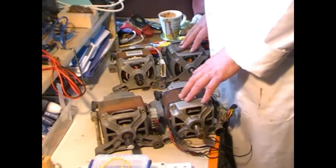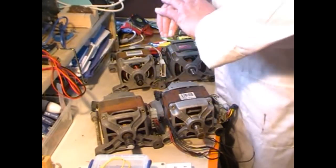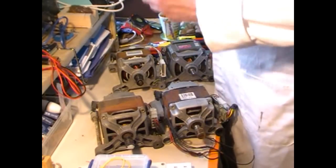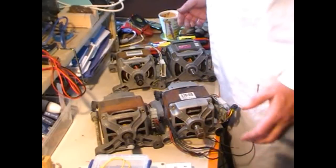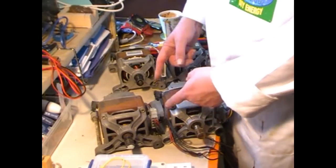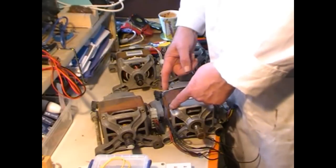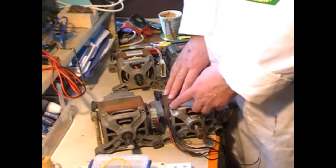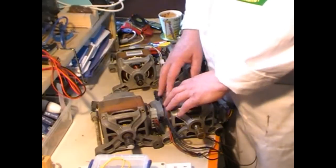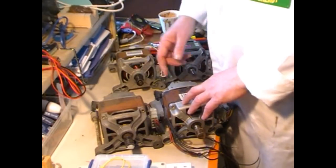The first thing that I do when I get motors, I haven't done it yet with these, I did it with a test motor, is I strip them right down, stick everything in a bath of soapy water, clean it, take it all out, this is coils and all, dry it off thoroughly, and then reassemble the whole lot. And the main reason for doing that is all these motors are riveted, not nut and bolted together. And I want to replace those rivets with nuts and bolts. So if on the road I do have a problem, I can swap the motor out, but that evening I can take the motor, take it apart, find out what's gone wrong, sort it, put it all back together again. I've then got my spare. It's a bit like sorting out a spare wheel on a car, I suppose.